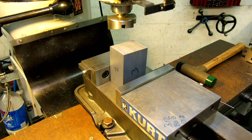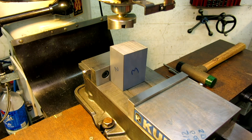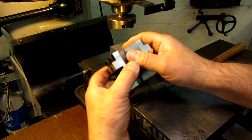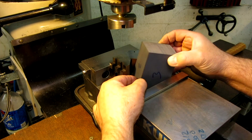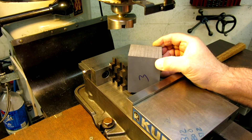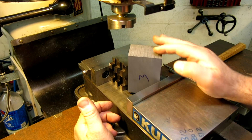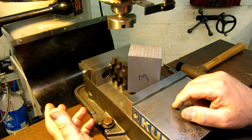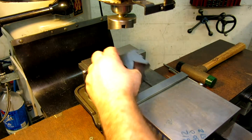I'm going to show you a way that we're not going to use, but it's actually a cool way to do it — and that is you can use a V-block. To me, this is cheating a little bit. We would stick the V-block in there like that, put two sides against it at once, clamp it gently so you can see — these are up against the V. So now we're square with the world and we can dust that off. It's boring, I don't like that one. So we're going to do the clever way instead.